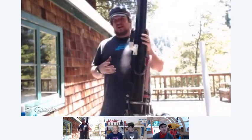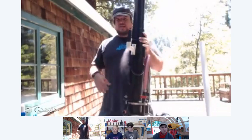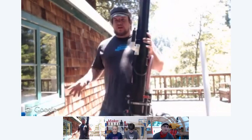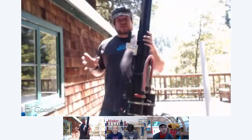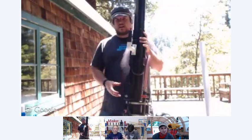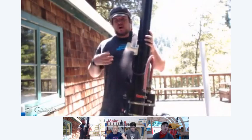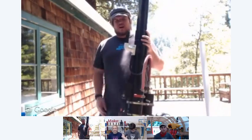So the low-end ones will use Schedule 80 or Schedule 120 PVC, and then the high-end ones will go all the way to metal combustion chambers and metal barrels exclusively because they're working with such high pressure. They're also a lot more sensitive, so you have to have very accurate pressure gauges and valves in order to work. And also, as the pressure increases in here, the resistance of the air increases, so the spark doesn't work as well. So you have to have high voltage ignition sources like stun guns or actual car ignition systems. But they're really cool.